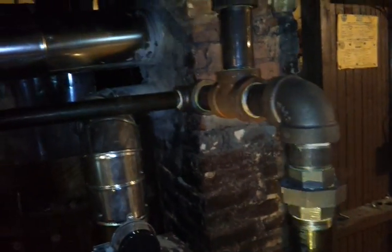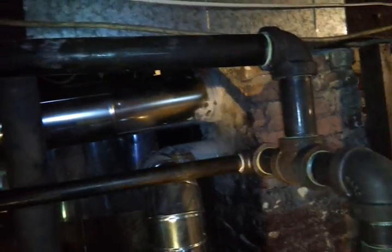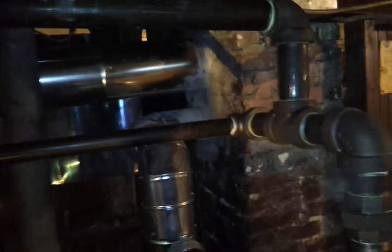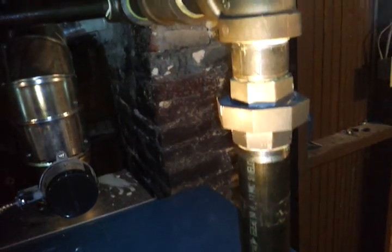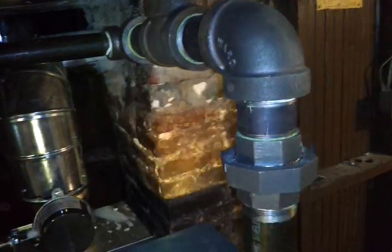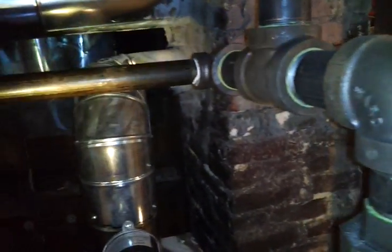This is a steam boiler. When you deal with steam, you have to adapt to existing conditions. Steam gets piped a little differently than other boilers. In a steam system, you want to keep the steam dry — you don't want too much water in the steam. So when it comes up, you'd like it as a dry vapor. For this reason, we put a lot of drains and pitch everything. If you don't pitch it properly, it could bang in different areas.